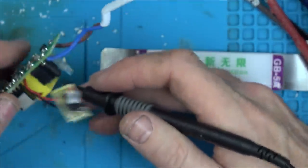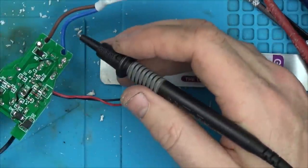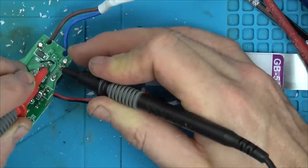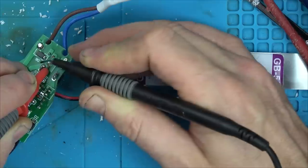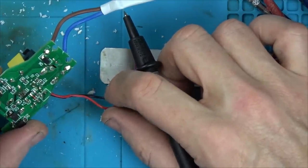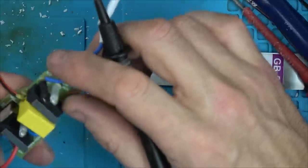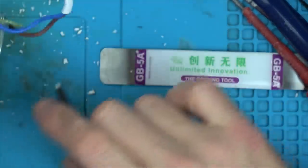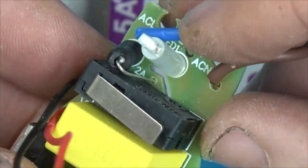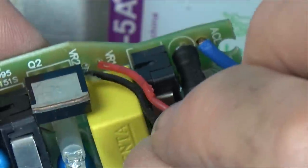Let's have a look — I reckon it's the fuse. Ha! It's the fuse. Yeah, the fuse has blown. What caused it to go — could it have been a power surge, or is something else on the board at fault? Let me zoom in — it's a T2A, two amp fuse. That little wire has come out. I wonder if I can just put something in its place to see if it comes to life.